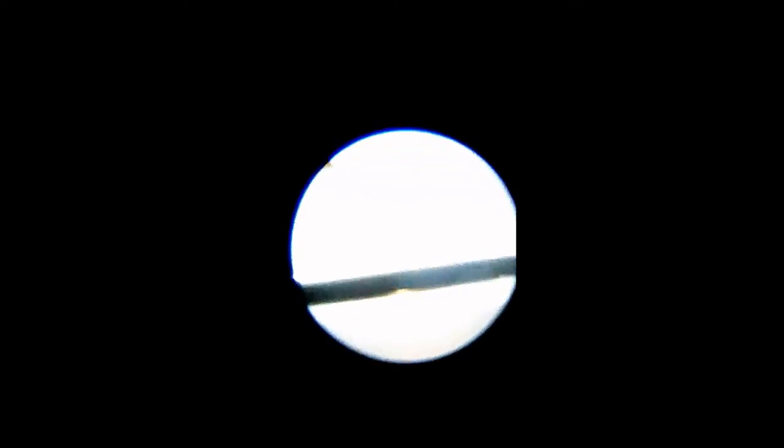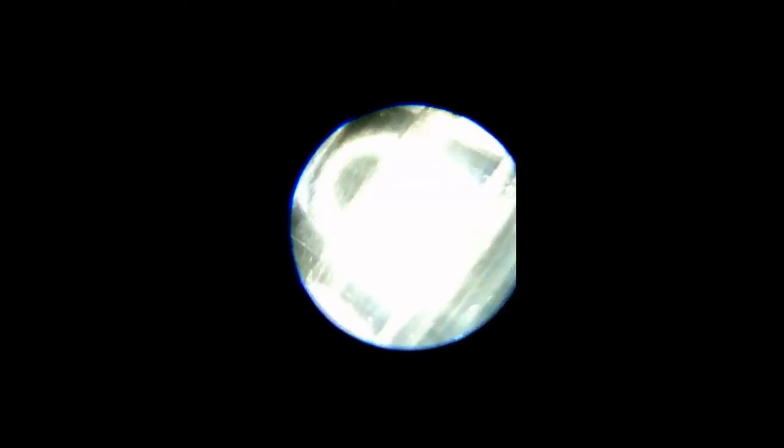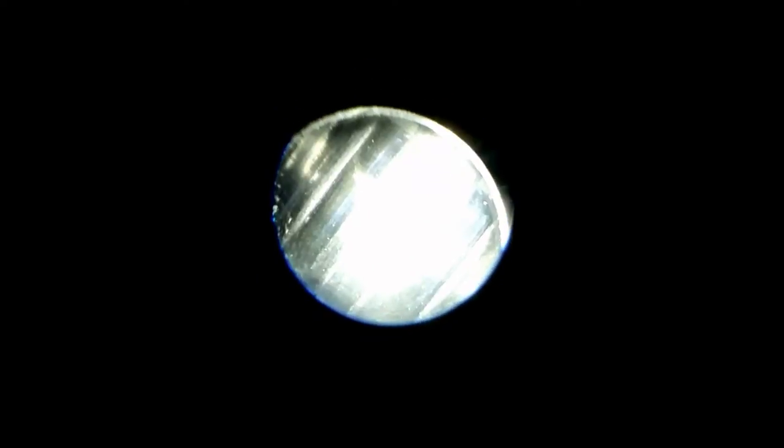That's the Hawkeye. Now I'm switching over — actually, first we need to look through the 90-degree mirror attachment. We'll look down through there and you'll see what we're seeing as we look through the mirror. Looking in that mirror becomes the weak spot of this setup, but it does give you the view. If we came down the barrel and saw a bad spot, that's when we'd put the 90-degree mirror on for a closer look.